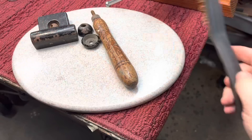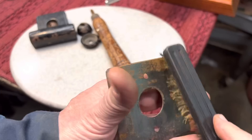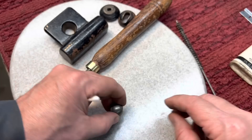This is going to be a fun, quick restore. The first thing I'm going to do is take a soft brass brush and we're just going to scrape what you see here — just getting off some of the surface rust. We're not going near the edge, just getting rid of surface rust. Then we're going to dump this in some Evap-O-Rust. I took this over to the wire brush, cleaned the threads, the ferrule. And we took this round tubular brush and ran it through here with the drill press.